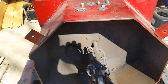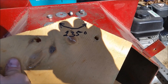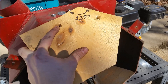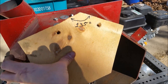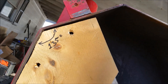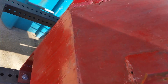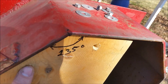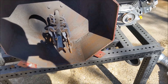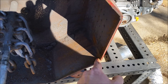I came up with this method. This is just a scrap piece that I cut — I don't have the original piece I used. But essentially I had a piece of acrylic shaped almost exactly like this. You want to cut the angle to where that angle is 135 degrees. These two holes that are drilled — I actually used a hole saw in my original piece. I put it in there and clamped each 8x8 square into these holes onto a piece of wood, then ran a couple of tack welds on the side. I moved on to the next piece, ran a couple more tack welds, and eventually had the whole thing tack welded up. By the time I got to the very last weld, I didn't have to bend or hammer anything — it was lined up pretty well.